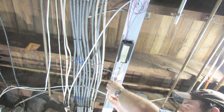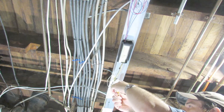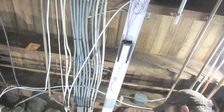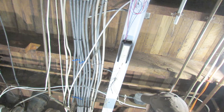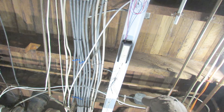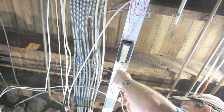I'm going to disconnect the hot and neutral right off the sockets. My sockets came off — I'll put them back on. There we go. So we got that done. Now we're going to cut the ballast out. Remember to cut so you have enough wire space coming off these sockets to reuse it.